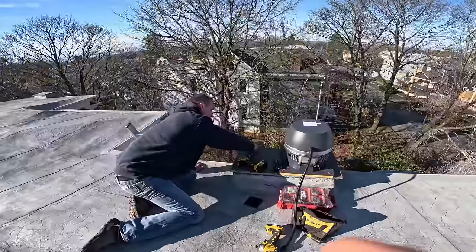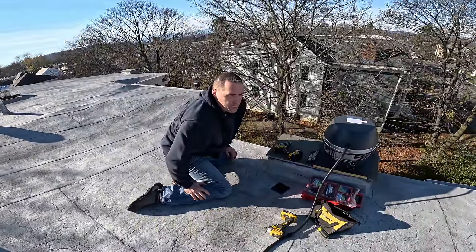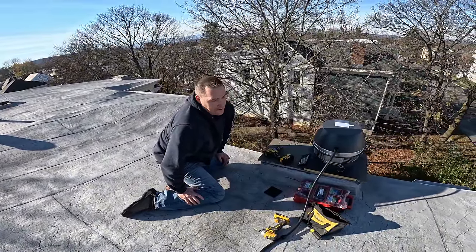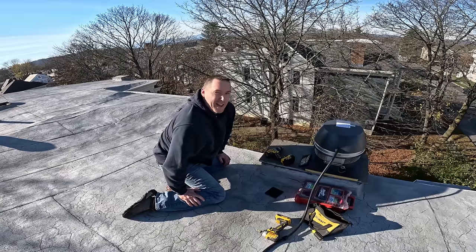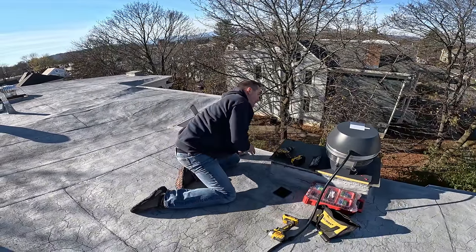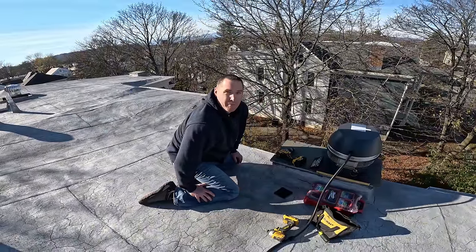As long as I can make it in, because we're going to be putting a piece of half inch PVC through the wall, which would be about 3/4 to an inch in diameter total. Okay. And then we want to send that in and get to that sub panel that's in the attic there. So if that goes well and you can see this bit, that'll be our path. And if you can't and that's not working out, then we have to find a different route. So we'll have to rethink another way into the building. Okay.